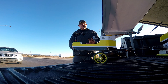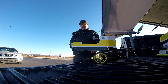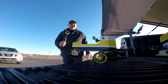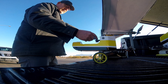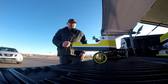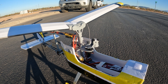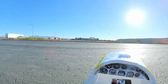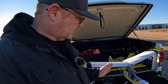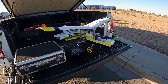You may have noticed I've added some color to the body using colored packing tape from Amazon — I'll share a link. I'm not a fan of duct tape, but this stuff is pretty light and works well. I've also got a 180 degree servo for the camera pan — it costs more than most on Amazon, but I have two now. I was able to extend it beyond 180 — it's almost 270 degrees. With the camera's peripheral vision we should be able to see almost to the tail. I also added thicker pushrods and I'm no longer getting the bending like before.